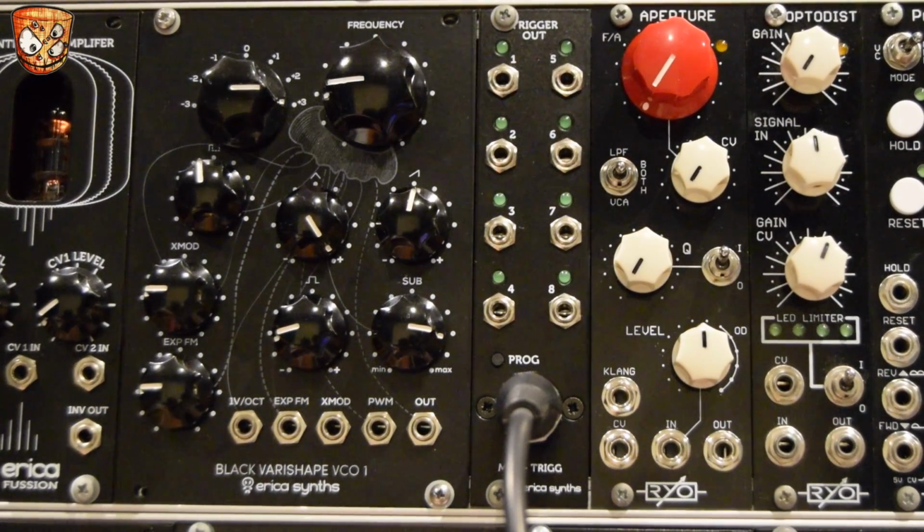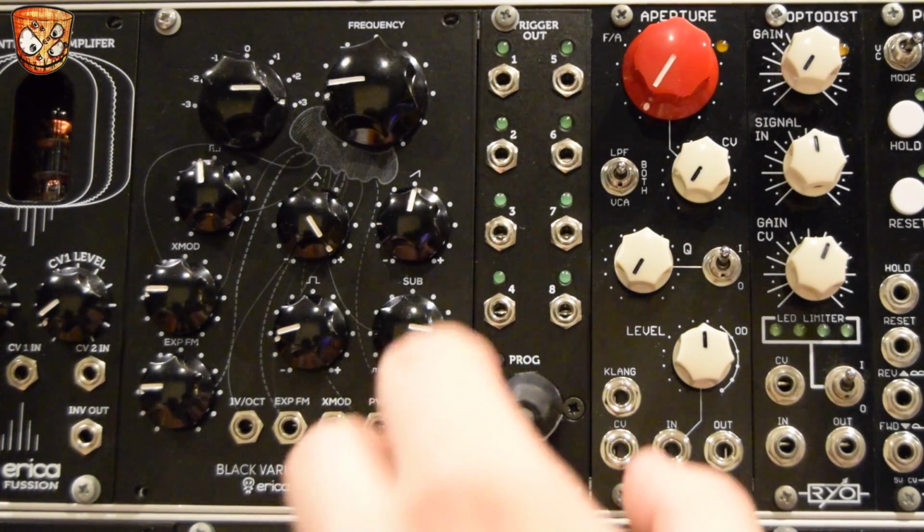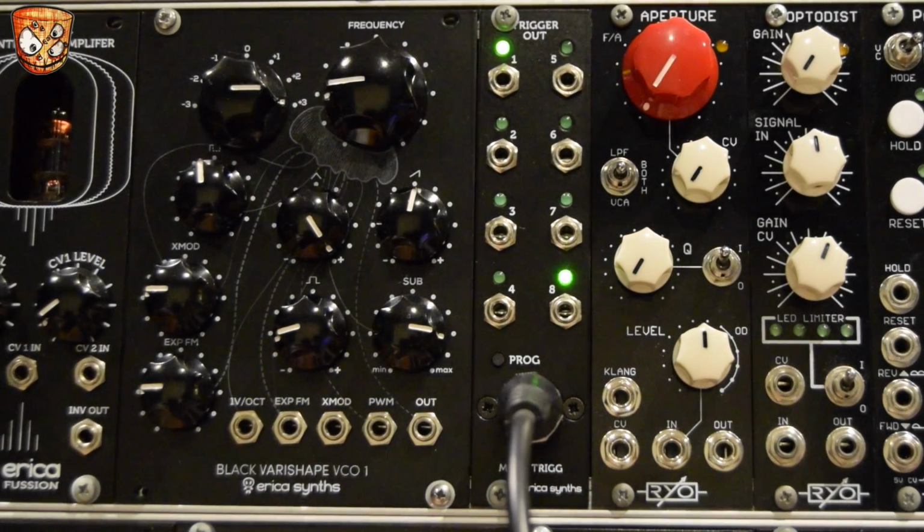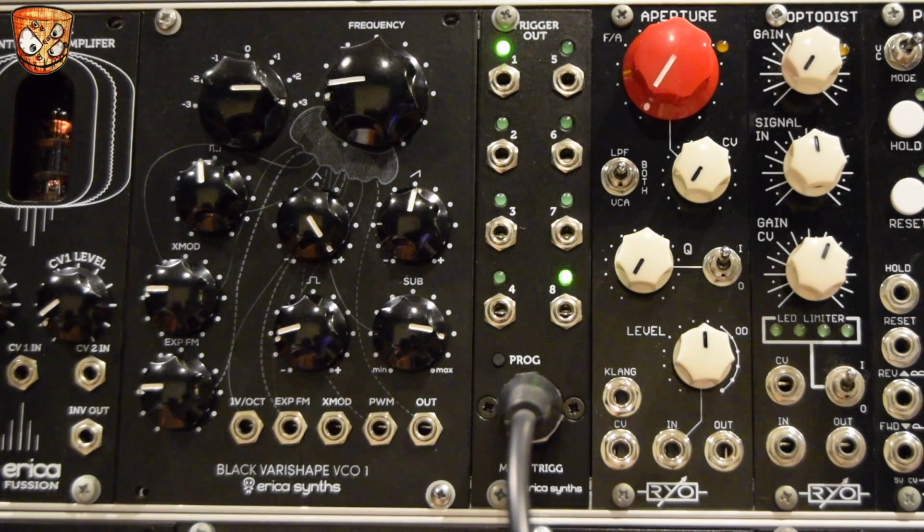And another little nifty feature is that if we want channel 8 on this MIDI to trigger to send our clock output without actually programming in a 16th note clock or something like that, either on our keyboard, sequencer, MIDI or DAW, we can hold the program button for 4 seconds. Notice this is now flashing to indicate our clock coming in.